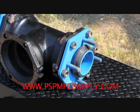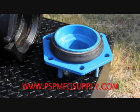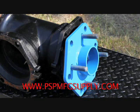The key advantages are the short pattern, so the space required to make the reduction is minimal, and the fittings joined by this MJ Compact Reducing Plate are securely restrained to each other. These MJ Compact Reducing Plates are designed and manufactured to solve a problem in installation, either by its compactness in laying length or the restraint inherent in the design.